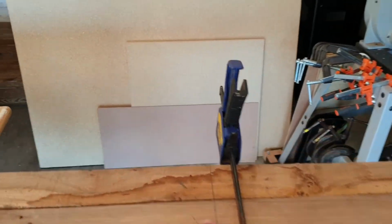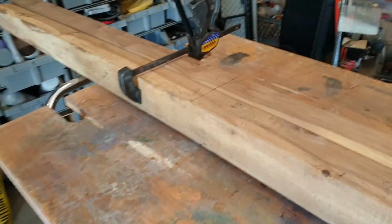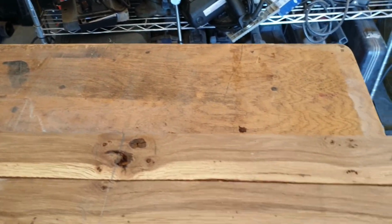Here's my stairs. There's 1, 2, 3, all the way up to 9 down through here. And these are in the position like if you're facing it going up the ladder. So I'll take that dimension, and then my rungs need to stay within 30 inches. I'm going to cut those out right now. Okay, there are my 9 steps.